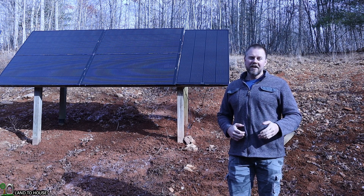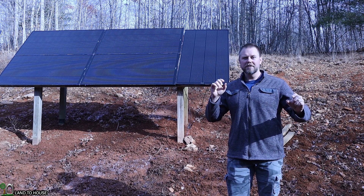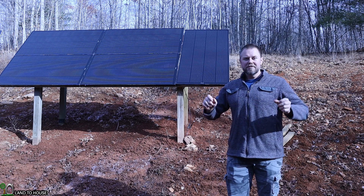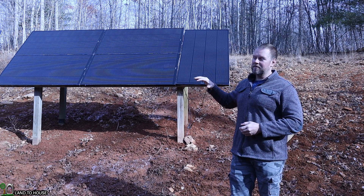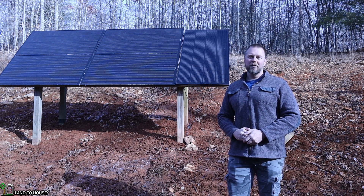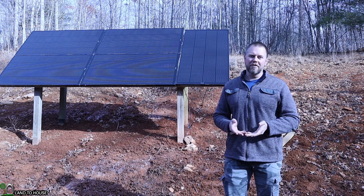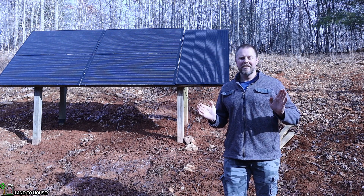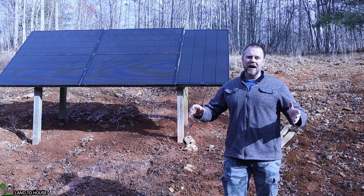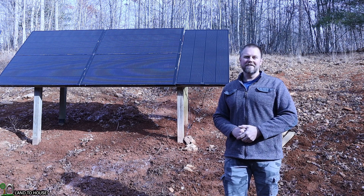The CALFA 200 watt solar panel is well built and easy to install. Out of the 1,000 watts of solar I have here, I'm getting 960 watts inside my workshop on a power station — these are performing very well. They have eight different mounting holes, which is four more than I'm used to on solar panels, and mounting locations for the ground on both sides. The frame itself seems quite strong and the monocrystalline cells are very uniform with no variation in color, which is also good for aesthetics. The only downside is that protective plastic around the entire outside frame — it's just really difficult to peel off. The shipping material was great; all five panels arrived safely in individual boxes with no issues.